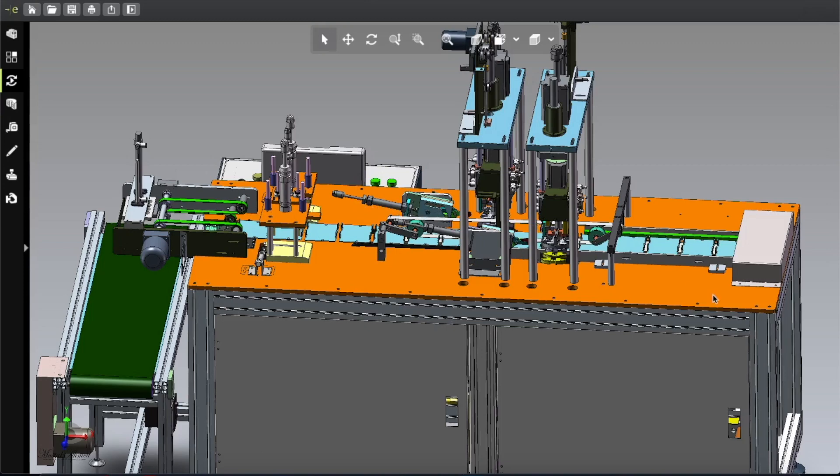Here is a central belt — masks come along one by one via this belt. This machine is connected by a conveyor belt to the main cutting unit, so masks automatically come here from the cutting unit. Alternatively, you can manually insert masks one by one. The belt runs and after the mask arrives here it is automatically sealed one by one.